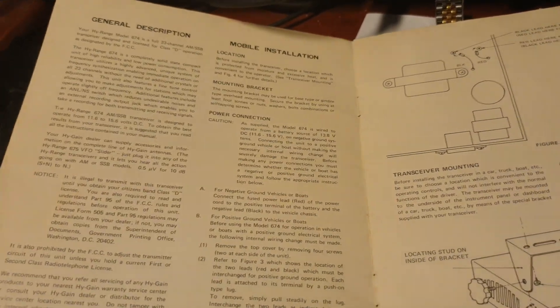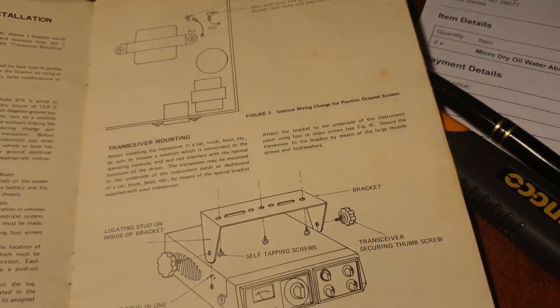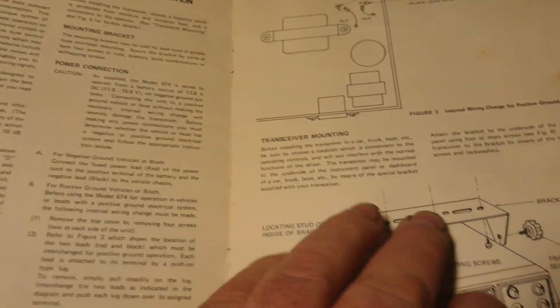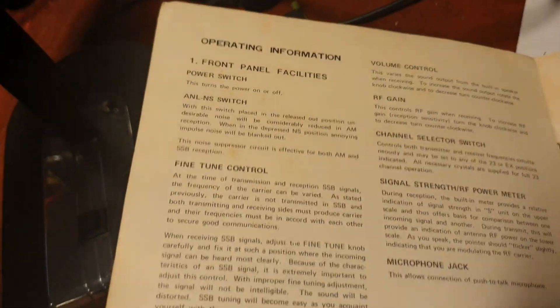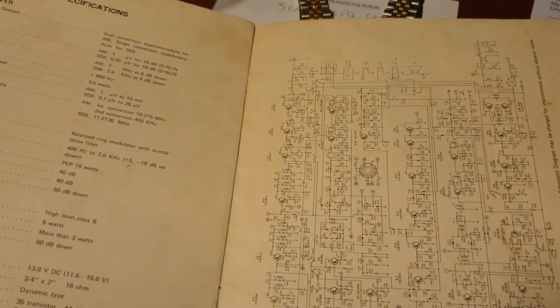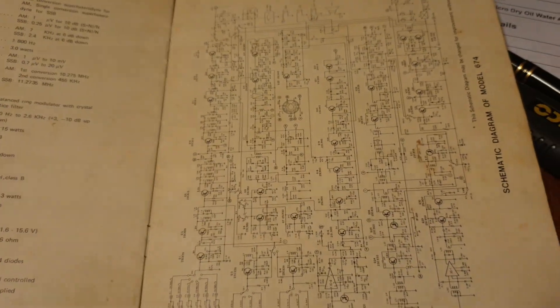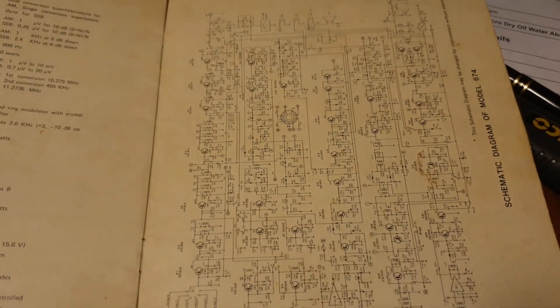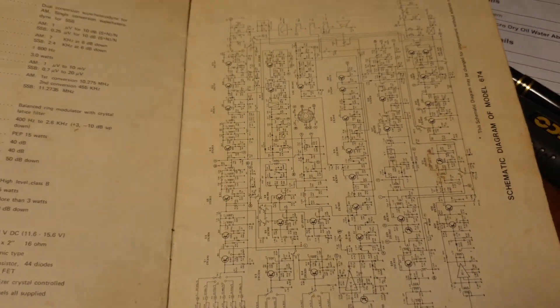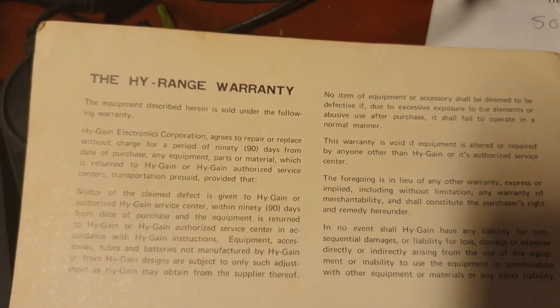There's a bit of shadow from my microphone, but it's a little bit better here. This is just having a look at power connections — usual sort of stuff, just where to hook up. Then we go over to the front panel facilities, talking about all the knobs, dials and bits and pieces, what those rear jacks do — a very standard book. Oh, there is a circuit — good. One page of normal specs that you'd see on one of these radios, and a circuit, which saves me having to go to my Sam's book if I want to do something. The audio on it is a little bit crass to be honest — I'd probably want to have a look at the driver stage and see what's going on.